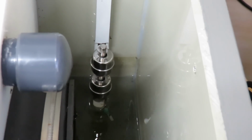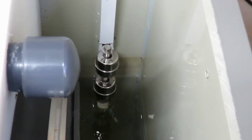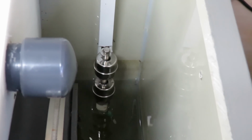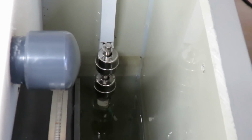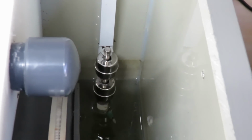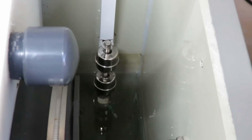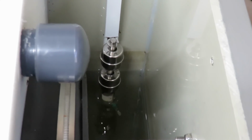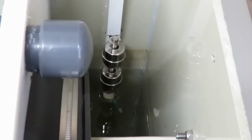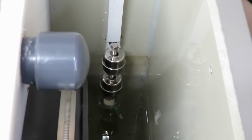Obviously I don't want the UV on as well if there's no water in it, so it does shut down the pond pump and the UV light. I mean, it'll probably never be used, but it's just a safety precaution really, so that if it ever did overflow or overfill with water, that top float will cut it out and stop the pump. But it cuts it out for a period of time, so that when the water level does drop back down, it will cut back in and try re-triggering the float switch that does the cleaning cycle, the bottom one. If it still doesn't trigger, and the water level rises to the top float and activates that, it'll shut the pump down again. And it will continue shutting your pump down until the problem is rectified.